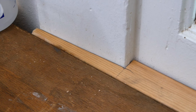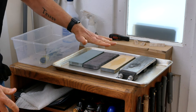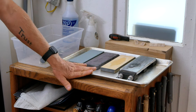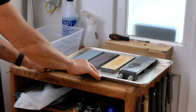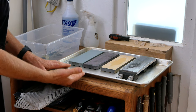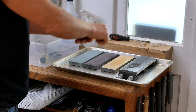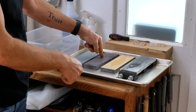I've custom-fitted a couple blocks between this cabinet and the wall so when I'm really pushing on this while sharpening, it doesn't wobble back and forth — it's nice and solid, and that's important. On the backside of my sharpening tray I've also got another block between it and the wall so when I'm sharpening it doesn't move. You want this whole thing to be set up at the most comfortable height you can. For me personally, that's about 36 inches — I'm about 5 foot 8 inches tall. If you're too high you're going to have a tendency to trip forward and damage your blade and possibly your stone. If you're too low you're not going to be able to get good pressure, so you're not going to sharpen very efficiently.